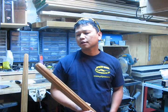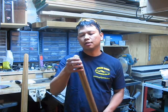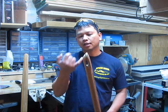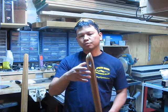In this video, I'm going to show you guys how to machine a band access slot. A band access slot is a nice feature to have on a spear gun, and it's basically this slit here on your muzzle, and it allows you to slide your rubber bands, your pre-tied bands, into your gun. Also, you're able to remove the bands quite easily.